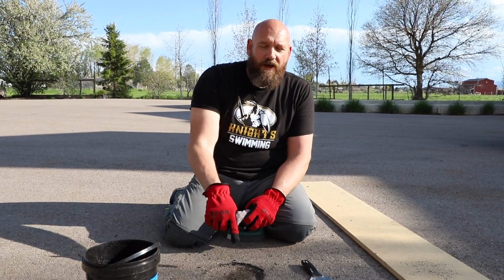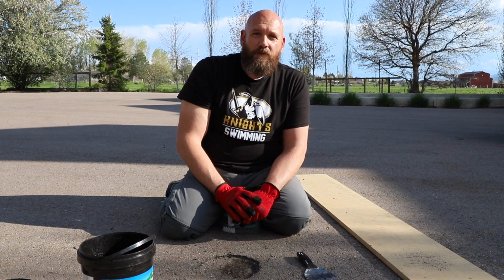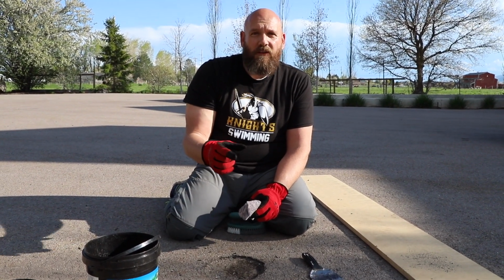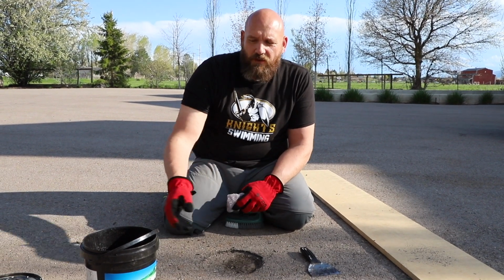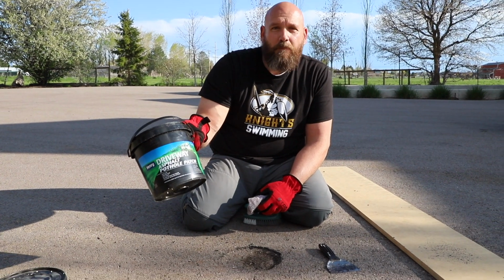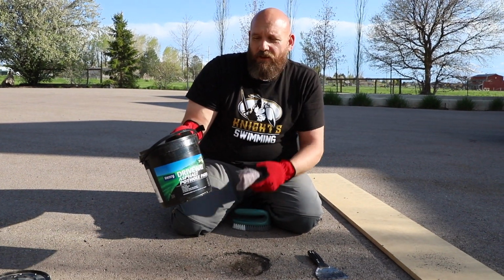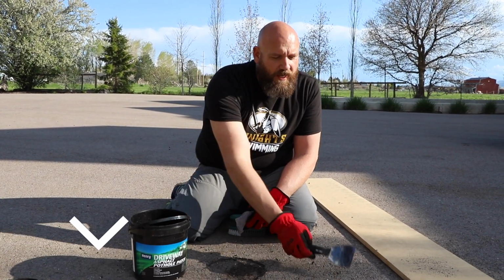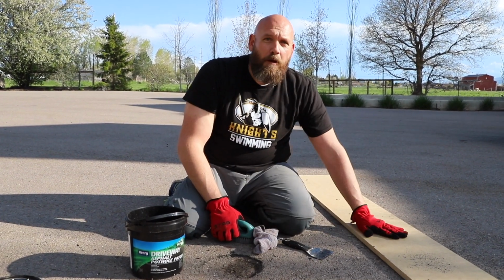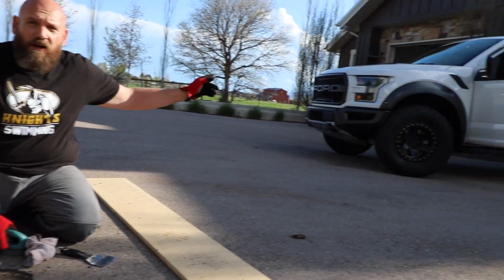Today we're going to fill a pothole in the blacktop. This is a technique you could use to fill a pothole or a large crack bigger than an inch or two. And you just need a few things. You need some driveway asphalt pothole patch. This is a product by Henry. I'll put the link in the description below. And anything to spread it out and something to clean the area with, a board, and a truck.